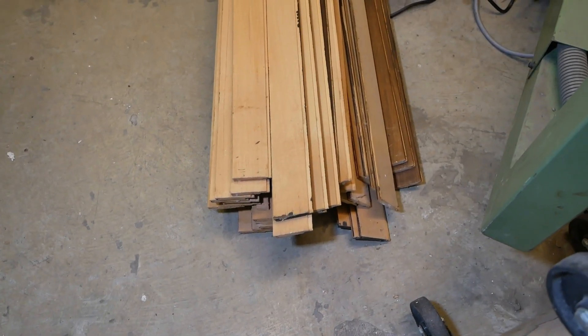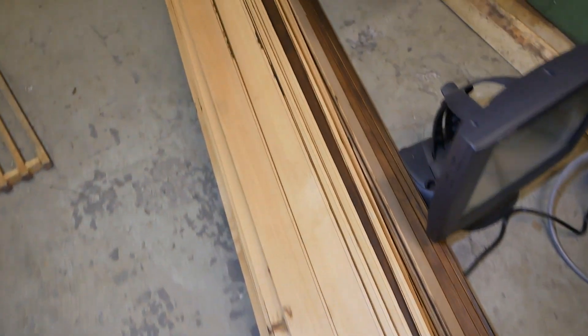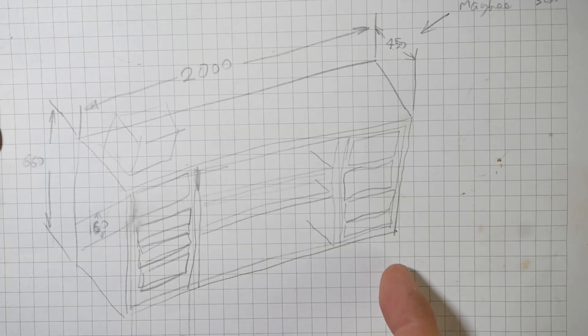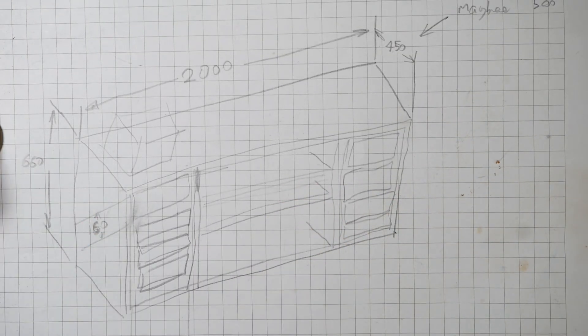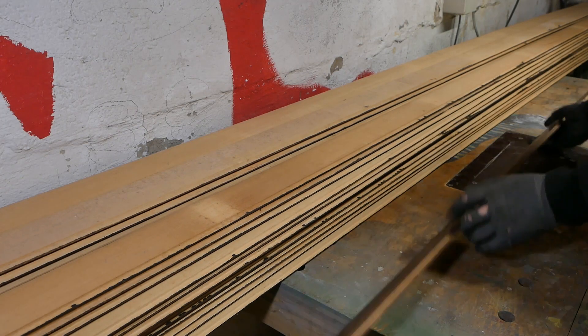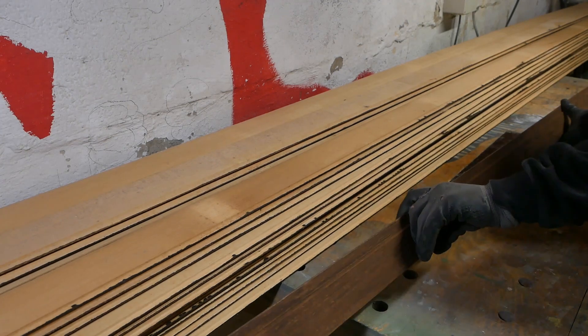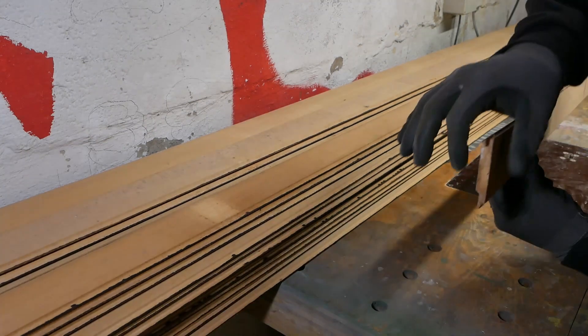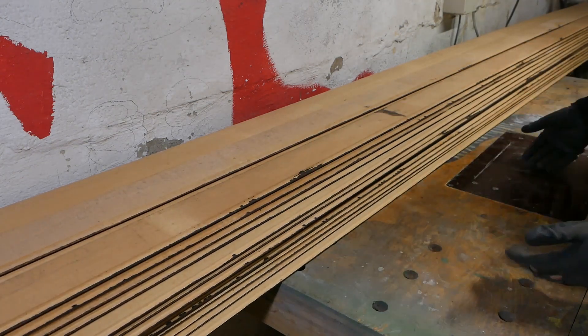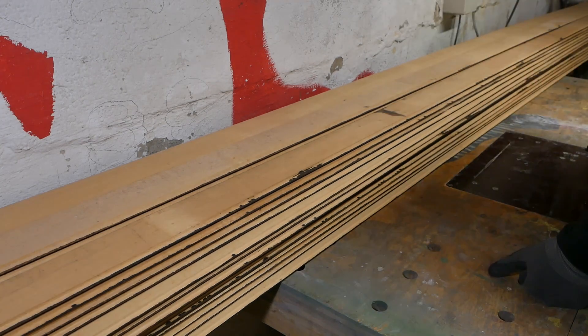When I moved in here, all of the upstairs rooms had this tongue and groove wood paneling on the ceiling. I took it all down because it was a dumb idea — there was a lot of mold behind it. I made Mrs. Rotary S&P a nice office desk by laminating a whole bunch of these strips of wood together. It was a bunch of work but my mate Anton helped me. Now it's time to make the matching side cabinet with shelves. I first need to cut them roughly to length with a bit extra, then cut the tongue and groove off both sides. They're also slightly tapered, so I need to pull them through the thicknesser to make them parallel, and only then can I epoxy them all into a slab and continue building from there.